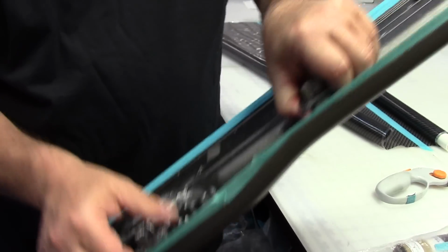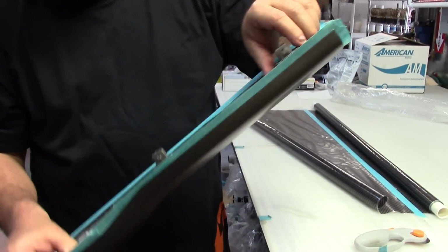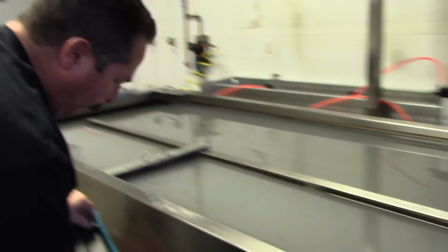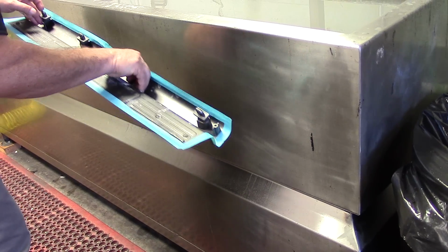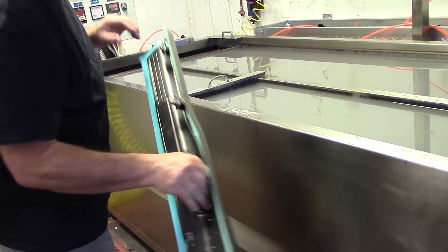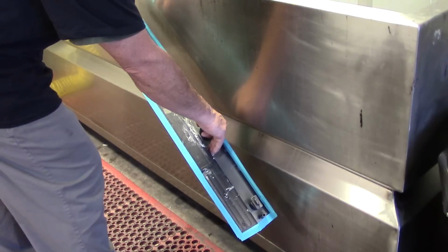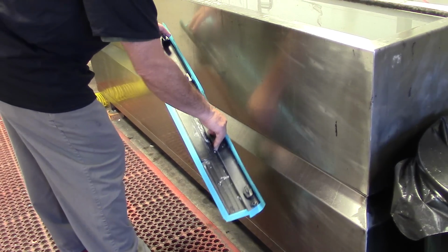So once you flatten out at a smaller angle, you're going to trap air in there. So you want to keep a severe angle to let the air get out, which means that when you look at your tank, once you finish dipping at a 45-degree angle, you could go in shallow, but you may trap air in all these little nooks and crannies. So you want to go in at a steeper angle, and you're going to bottom out on a shallower tank. Once we get done, you'll notice how far into the tank I am on this part.